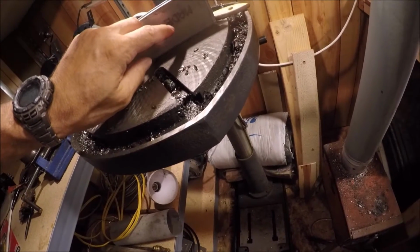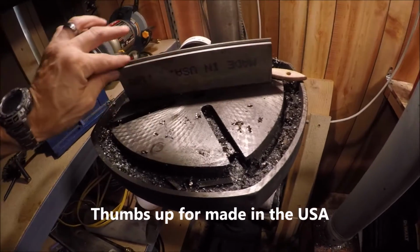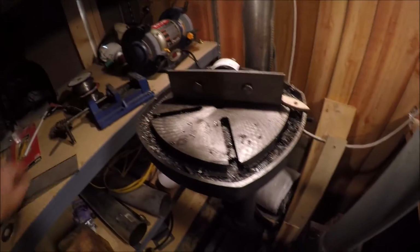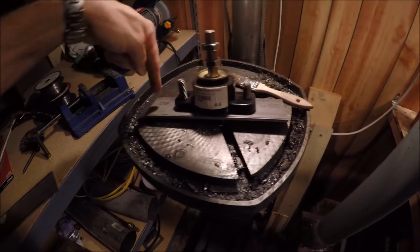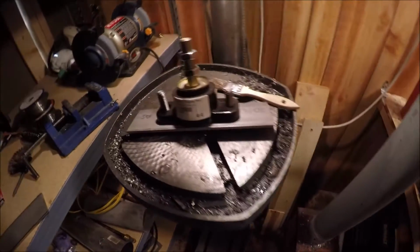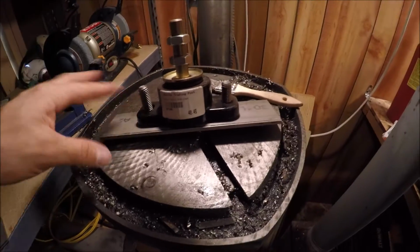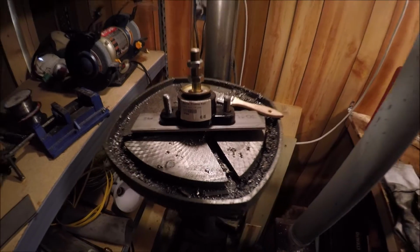Then this will slide on over those. The bolt heads will get welded in there, and then we'll also weld along the side here, and then we'll have new holes drilled here for the half inch stainless steel lag bolts that will bolt this whole contraption to the sailboat.